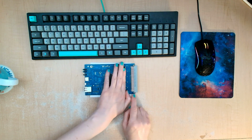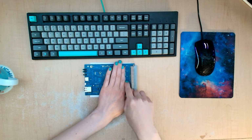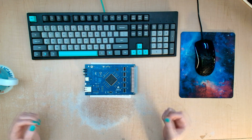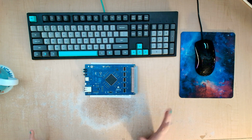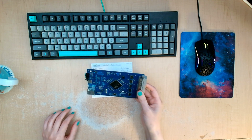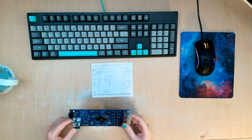So then these transceivers, which I would still need, would be really tight in there. I'd have to put them along here. I would maybe only get four sticks in maximum. And it'd be something like 128 megabytes that I could fit on there with some old 72-pin RAM. So I moved away from that idea.